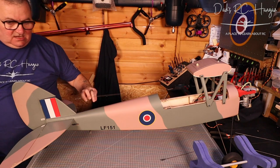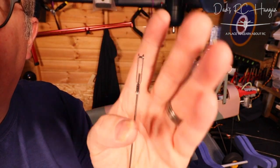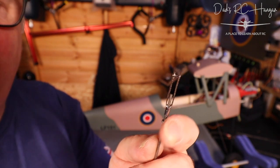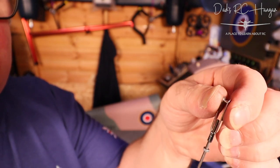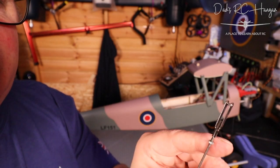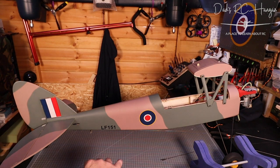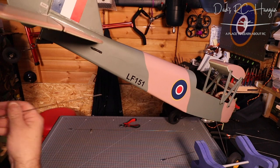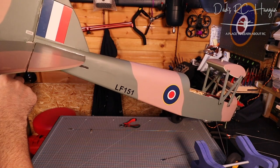On these clevises, let's get up close and in focus. On this here, they've got a little nut - once again I'll put some blue Loctite on this so it doesn't rattle, move, or twist. It's held at this end and held at that end, but you never know, so I want to do that in the middle. You've got plenty of thread either way. Before you start cutting and tightening, make sure you set these at the middle - that's the little tip there.